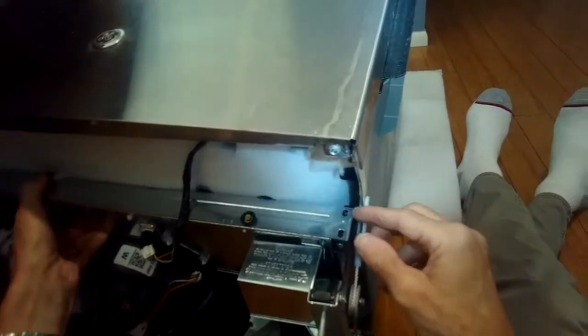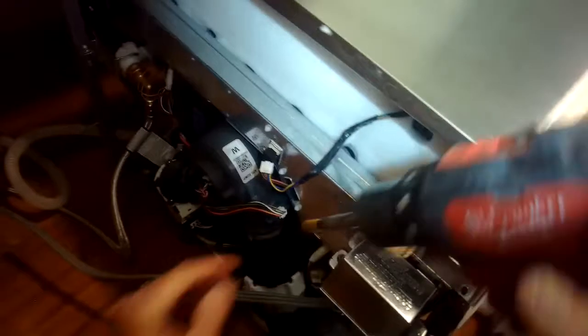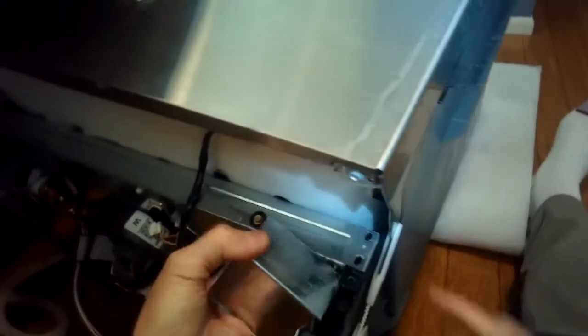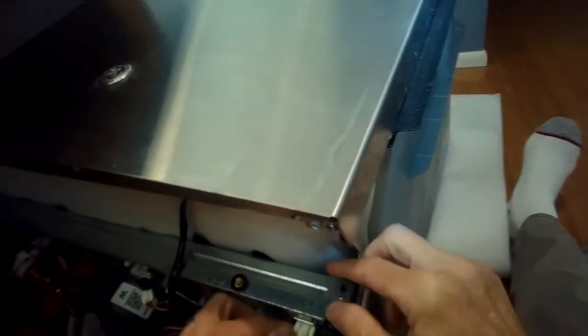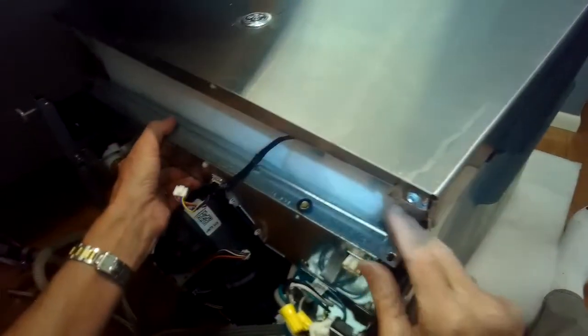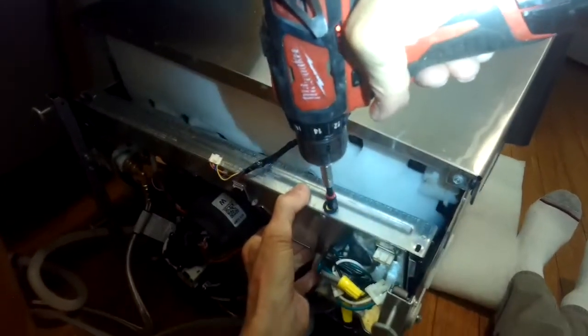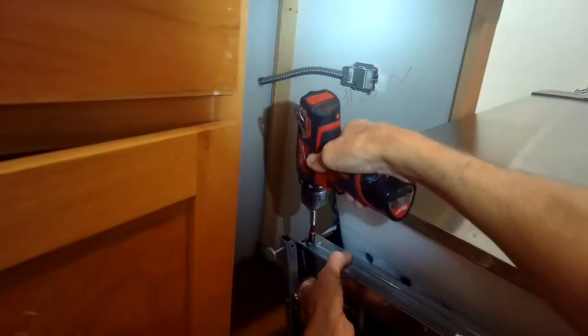These are the wires coming into the controller. I'm taking out another screw on the junction box — it turned out to be a bigger one, maybe seven-eighths inch. I pull up on the sheet metal cover, and there's a little modular power connector here. I depress the tab and disconnect the power connector that brings power to the controller — it's all modular; it comes right out. That's the whole controller. A couple of small screws let you take the cover plates off so you can pull out the circuit board. When you buy the controller, it's just the circuit board rather than the whole sheet metal cover.